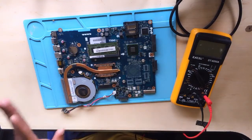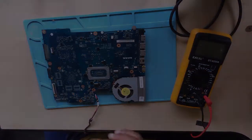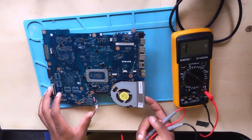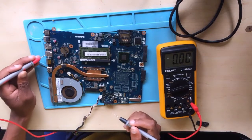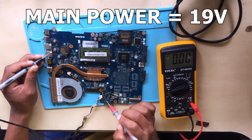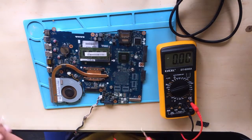This is very, very important - just stay tuned and watch and listen carefully. I have a charger here. Okay, it's turning on, you can see a light, the fan is spinning. Let's check our voltages - change your meter to 20 volts. Starting from the 19V input: we do get 19 volts, sharp. Moving on: 3.3 volts is there, and 5 volts is there as well.